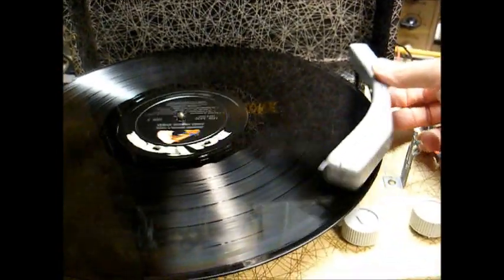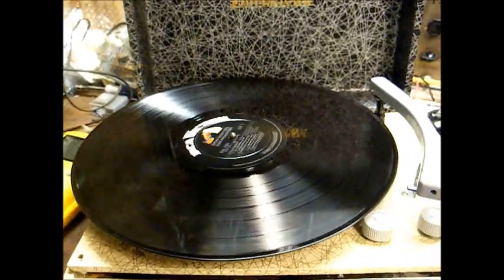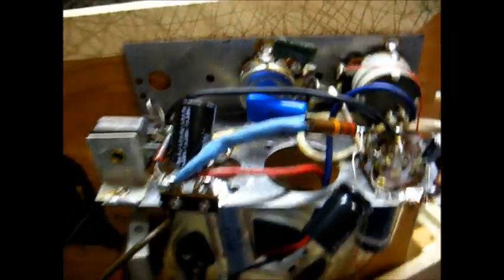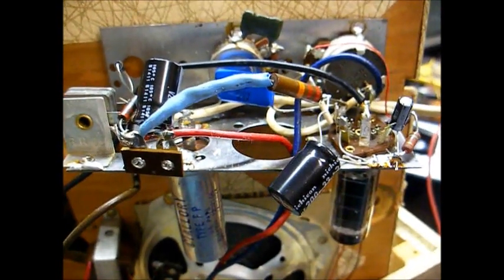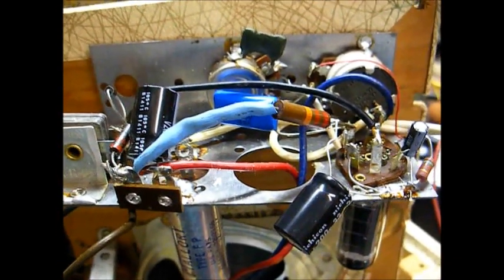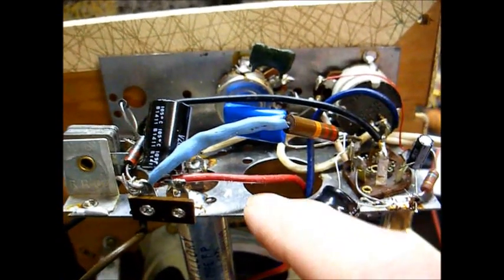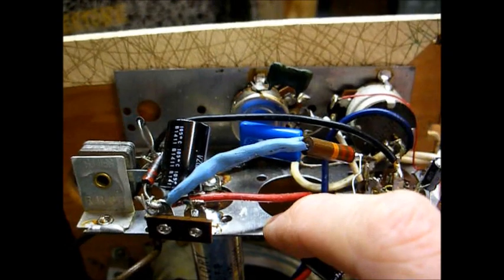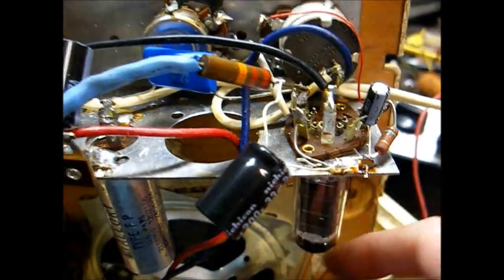So what do we do about this problem? We shouldn't have to crank the volume all the way up to get somewhat decent results. What we do is add an extra tube to the original chassis as a driver stage. In this particular set, I'm probably going to go with a 12-AV6 and mount an octal tube socket in this existing hole, and that will contain our 25-L6 output tube.